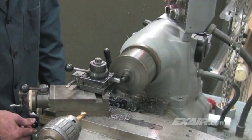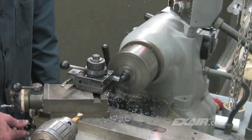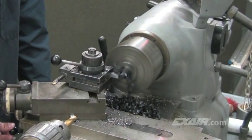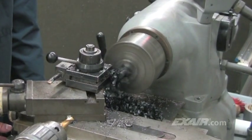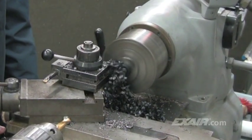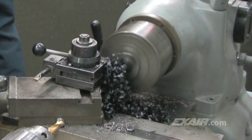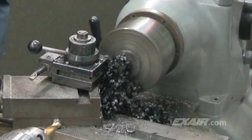Depending on the type of the plastic material that's used, it can easily melt and crack. In many cases, it gets gummy, which ruins the tolerances and the finish. The long stringy turnings can block the machinist's view of the part. For most applications, liquid coolant can't be used due to part contamination.